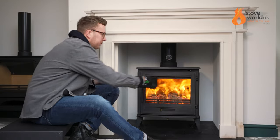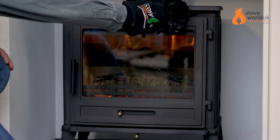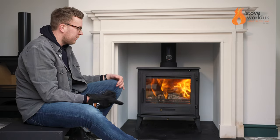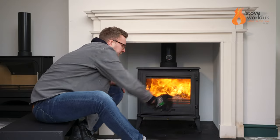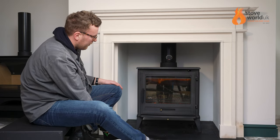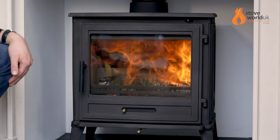And this is when the heat is going to be tumbling through. Instant. Then we'll just notch it in a little bit again, and you see you just get that little curtain here as the air is flowing through this vent. The advantage of this stove, going back to the approvals, is that it does fully close down. For those wanting to burn overnight, that is a big plus, and you also get this drastic control ability, which is really good. Open that up again and you'll see it's fully taking off. Close that one down and it's off again — then just open this one up a little bit and the air will slowly be getting through there again. So that's the controls of the stove.